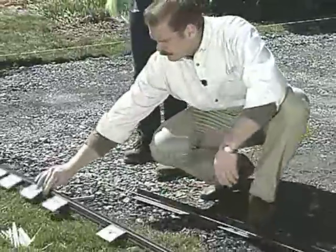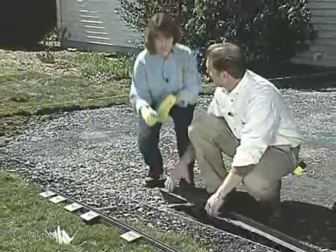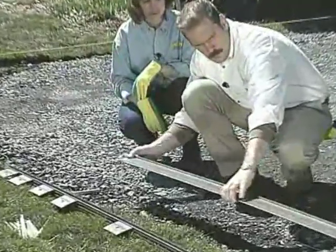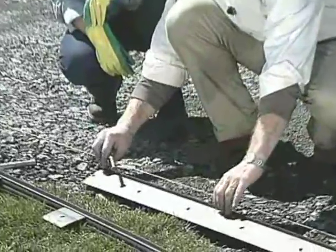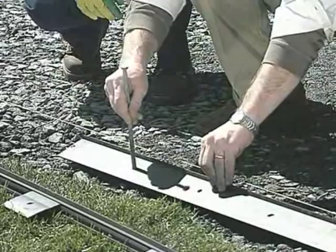Now, I noticed the pre-drilled holes. Yes, those holes are drilled out so you can put a 10-inch landscape spike in. Like this? Like this piece right here. What we want to do is line up this edge restraint directly underneath the finished edge of the patio. And that spike's going to go directly in that hole.